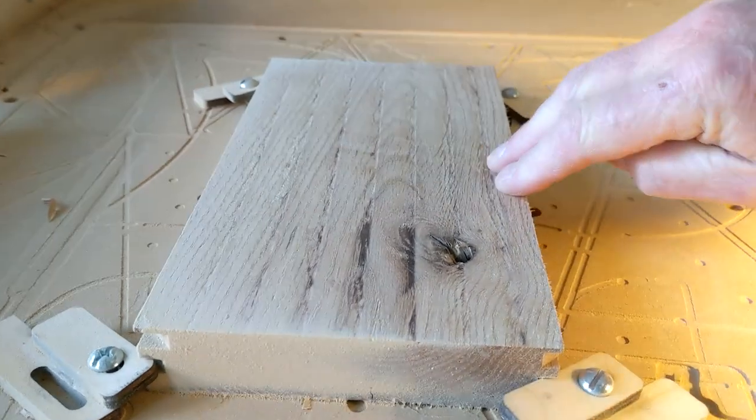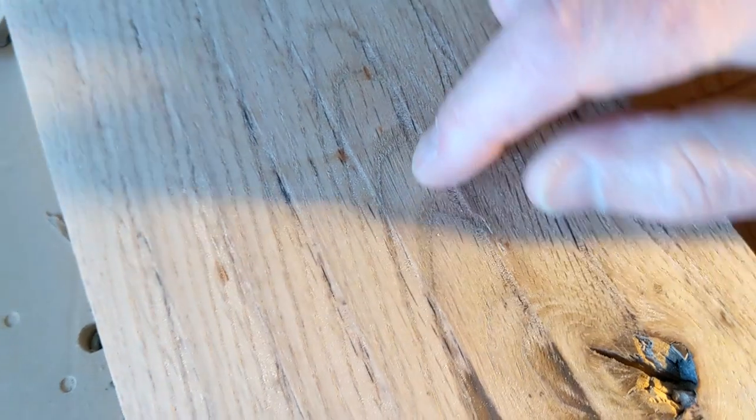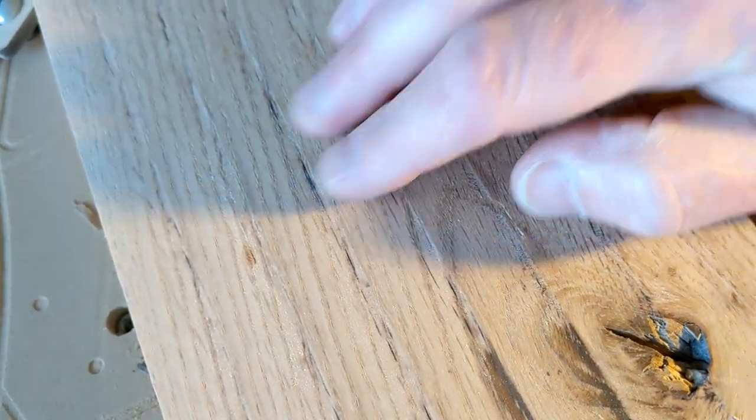I had my tool set at a 90% step over, which probably was a little too much. Probably should have gone to 70 to 80 step over. I'll explain that in another video. You want to watch my channel.